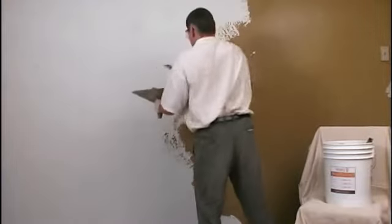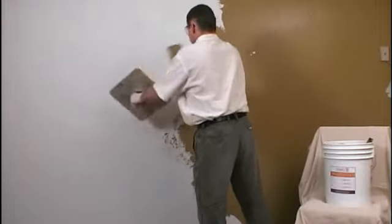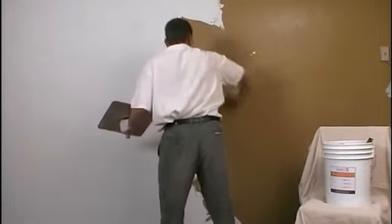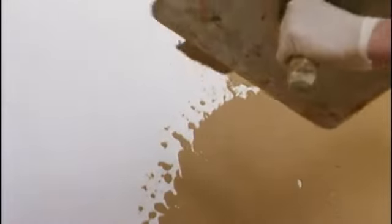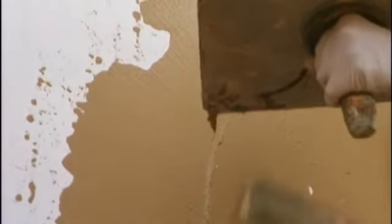Marmorino plaster goes on in 2 coats. The first coat should be applied at about 1/16 to 1/8 of an inch thick. Apply it like thick butter. Whatever texture you create on the first coat will show through as deeper variations of the color on your final coat. Minimal texture will give you minimal variation. Make sure you don't have any unnatural trowel marks on your first coat.